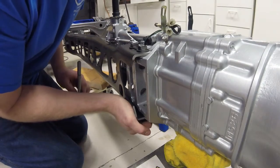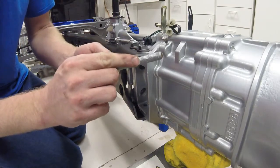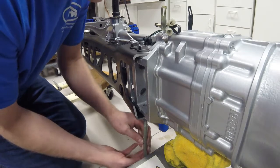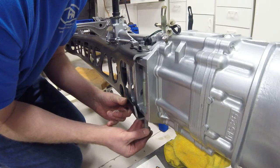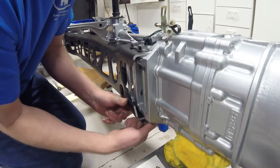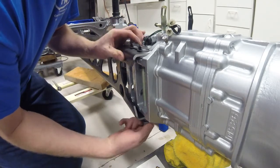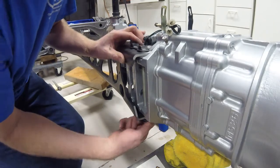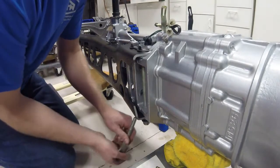So now I'm ready to put my bolts in. Just like on the rear power plant frame bolts, I've put a nice layer of anti-seize on there. If you've ever taken these off — and if you're watching this video, you probably have — you know what a pain they can be to remove. The anti-seize will just basically make that a little simpler when you need to remove them the next time.